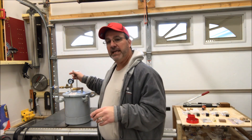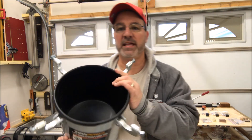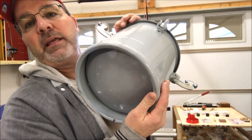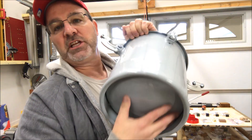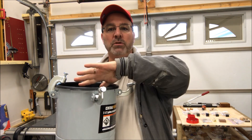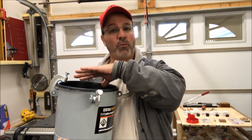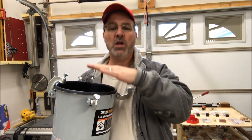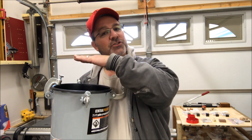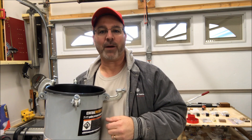What we need to do today is these pots all have a concave bottom. It might be kind of tough to see because of the black interior of the pot, but you can see a little better on the bottom. If you set a mold in there, that mold is going to sit on an angle and it's not going to cast properly — you're going to have more resin on one side of the mold than the other. So what I'm going to do today is just build a simple floor for the bottom of my pot so that any molds I put in will sit level and cast properly.